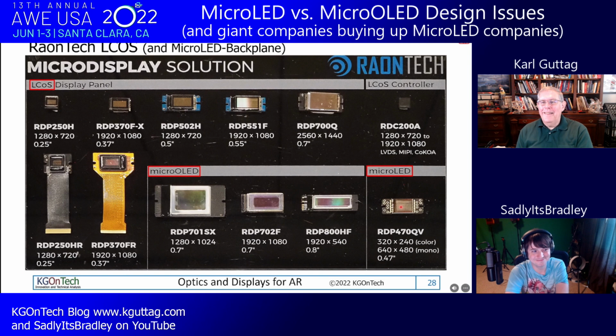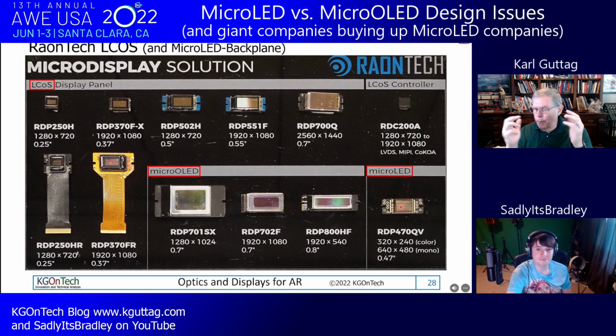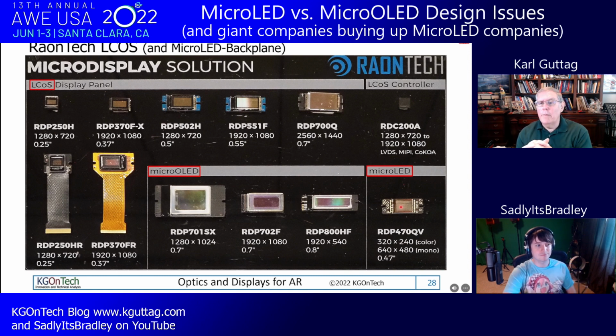Right. But what they depend on is what we saw way back with MicroOLED displays: a lot of this stuff is pretty sparse. If you're not trying to read a web page, which could be anything, including all white, but just put up arrows and directions, you might find that your average pixel value is less than 10%, maybe even 5%. Well, okay, now you're at 5%, so you've got 1/20th the power.